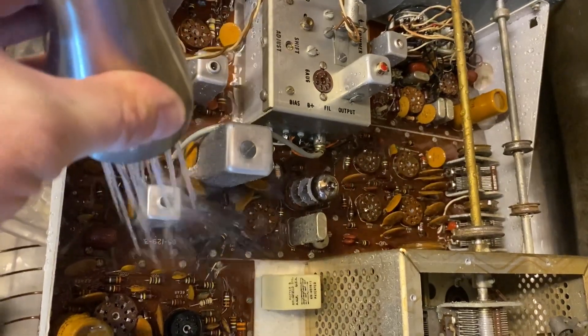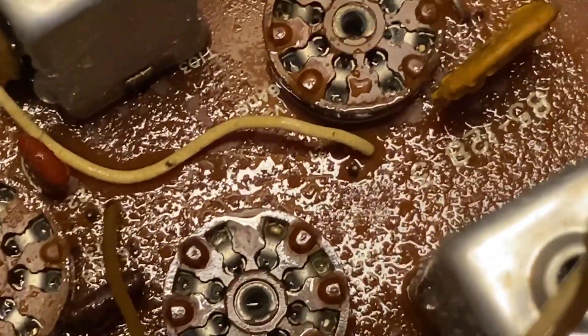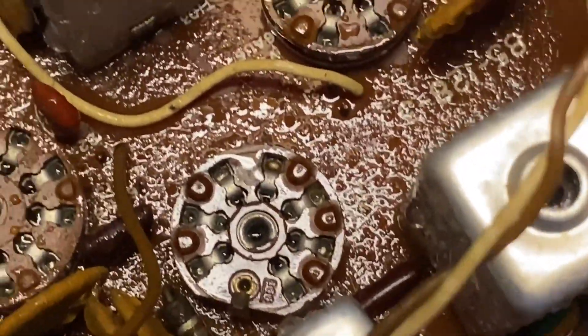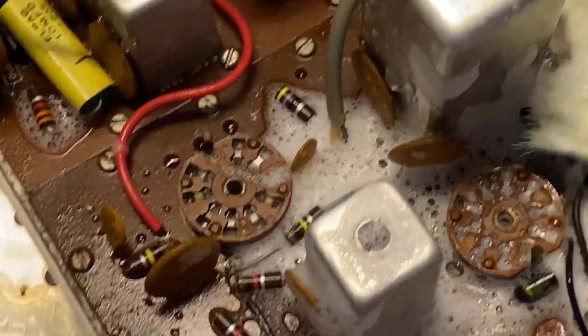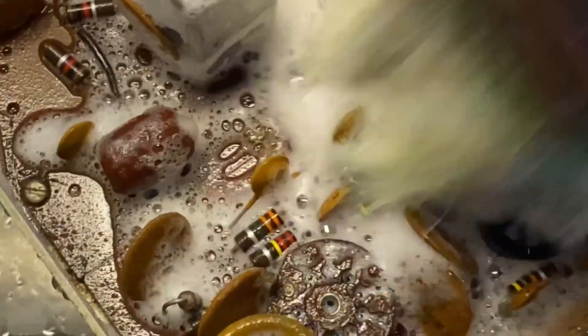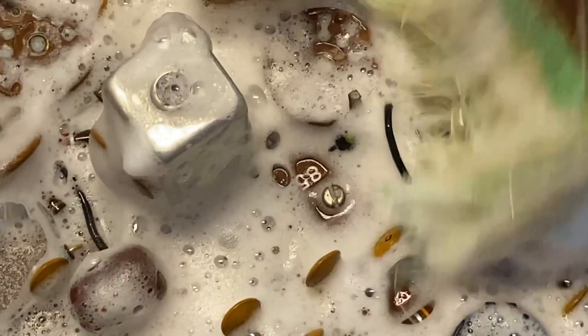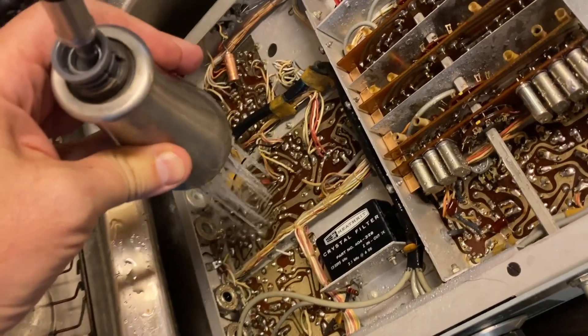This is the part that's been known to make grown men cry. I got this step from a retired Heathkit engineer — this is how he does it, and this is how I do it. This is just plain old dish detergent. I'm going to stab it a little because you can see that mottled look — that is some really baked-on grunge. You don't want to be so aggressive that you start snapping off capacitors, but I'm going to go in with a toothbrush into the areas with more resistant grunge, using progressively smaller brushes. I'll rinse it, and if there's still grunge, I'll go back and do it again — same thing on the underside.